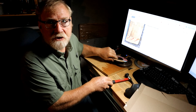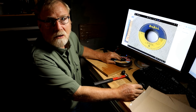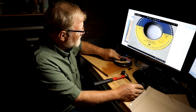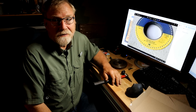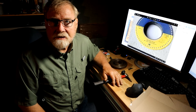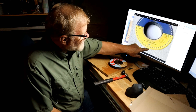But I still didn't know what a perforated blotter was until a viewer sent me a picture today. This is the only picture I've ever seen of a perforated blotter from Do-All. You notice it has holes around the outside — that's what they're calling perforated — that match up to the holes in this flange. Problem is Do-All doesn't make wheels for these machines anymore; they don't even make the machines. But I said: I can make that. I already know how to make the basic shape — I just need to punch 40 holes in the outside. That blotter also looks noticeably thicker than nine thousandths.